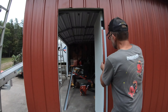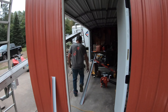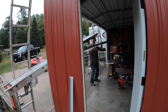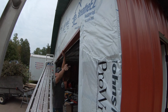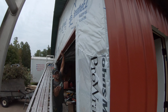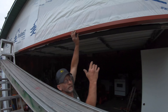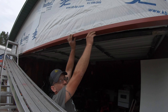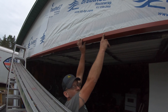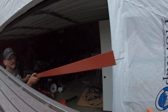To make it completely maintenance-free, I wrap the doors with this bent piece. Your inside will be red — there won't be any brick molding, because normally you butt up to that brick molding and then you have to paint it every three years or so, the paint chips off. Instead, there'll be this piece holding the tin, and J-channel goes on top of that. It's just a bent 3-inch by 1.5-inch 90-degree piece.